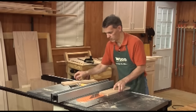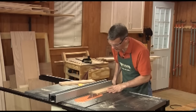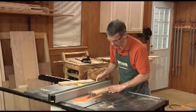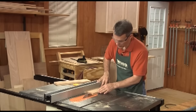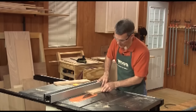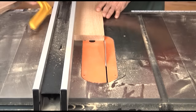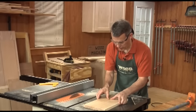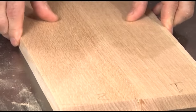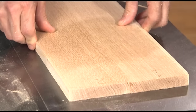A good 40-tooth blade — you need a very sharp blade to get the best edge possible. A good 40-tooth multi-purpose blade, or what they call glue line rip blades, is perfect for this job. When I bring those two boards together you can see I've got a nice clean joint line from one end to the other, and sitting here on my cast iron surface of the table saw you can see that those two boards lay flat.